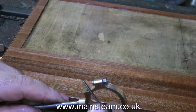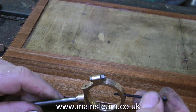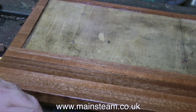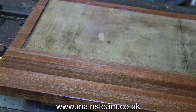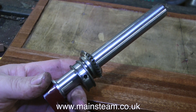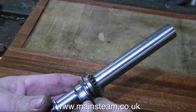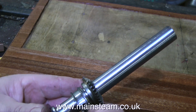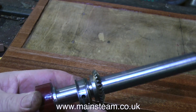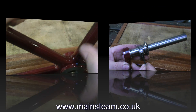This is the eccentric strap, and this is an Allen key. What I've done is drilled a hole in the end of the eccentric strap, which will allow me to adjust the position of the eccentric sheave on the crankshaft. This is to allow minute advancing and retarding of the timing. Because sometimes, if it's a display engine, you want it to be not quite perfect — a little bit lazy so it goes over easier over top dead centre. So you can make minute adjustments by doing this without having to remove the eccentric strap every time.